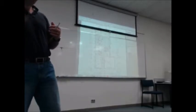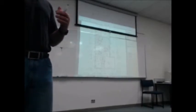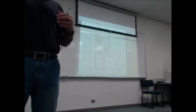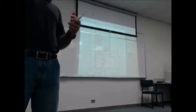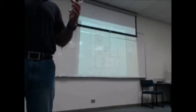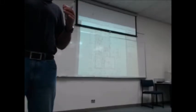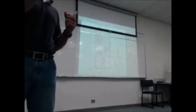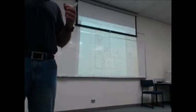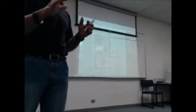You're on about foamboard polystyrene. Yeah. When polystyrene came out, we used to either not membrane it and not put the bandage on. We used to either just do the joints like plasterboard, or others used to membrane the whole sheet. The whole sheet was a better one. Now we get the boards which are pre-coated, so they've got the base coats on already, so now we've dropped back to just doing the joints. But it's not flexible, trowel on. It has a little bit of flex, but not a huge amount.